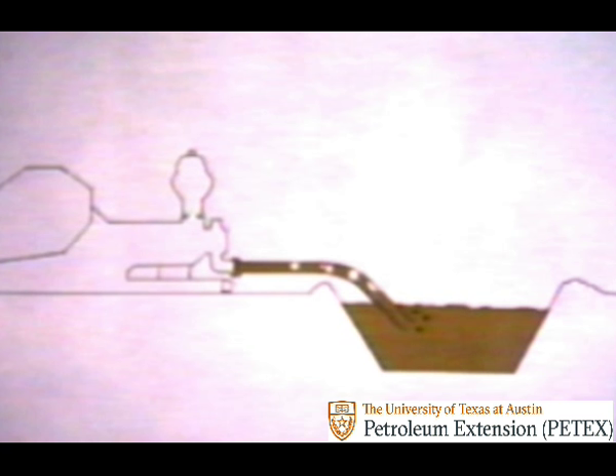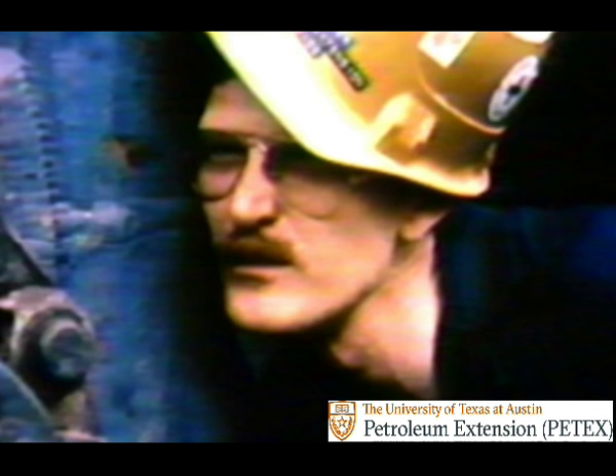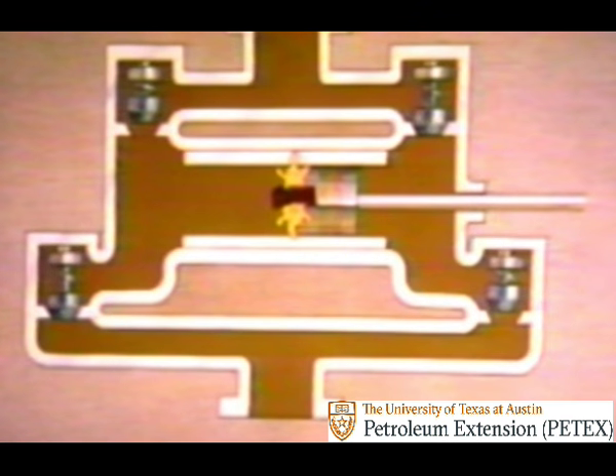This arrangement is most likely to end up with the pump working overtime because the suction lines aren't full. It could also cause fluid knocking. This means that there's not enough pressure in the lines to push the mud in as fast as the piston accelerates. So a vacuum is created between the piston and the mud. At some point, the mud finally catches up with the piston and smacks into it, and a loud knock occurs.